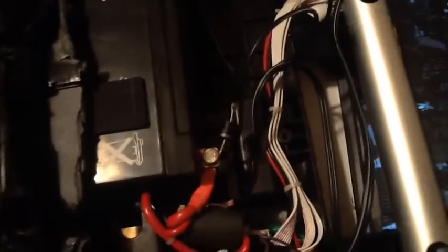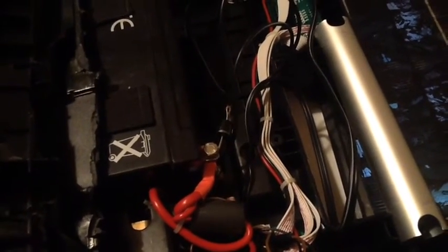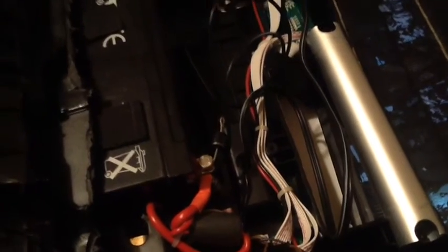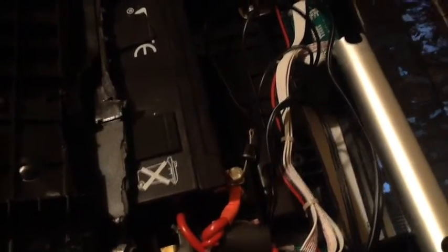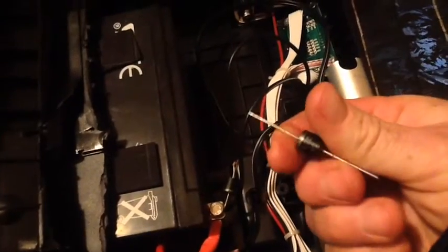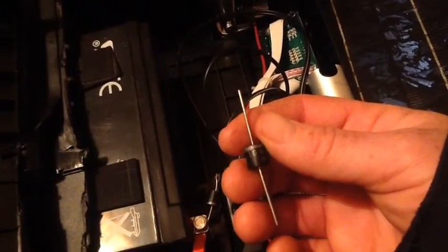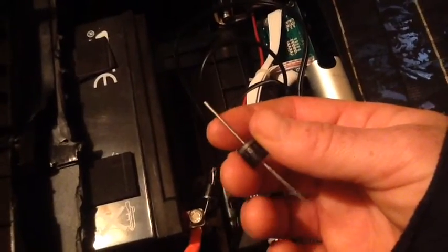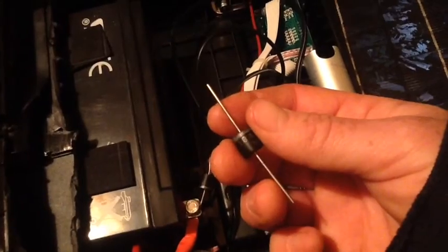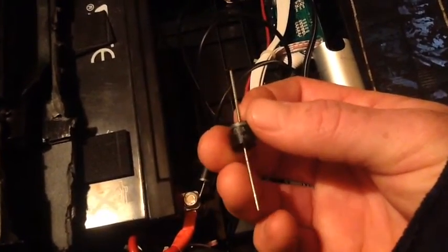It's not ideal to not have a charge controller, and I do have one on my larger solar systems, but for this little unit the battery is getting old anyway so I decided to just wire it straight through and monitor it. These diodes are handy for any solar project — a hundred of them off eBay for about five bucks with free shipping. This 10 amp one is a good round number; my individual 30 watt solar panels put out about 4 amps, so it works well.